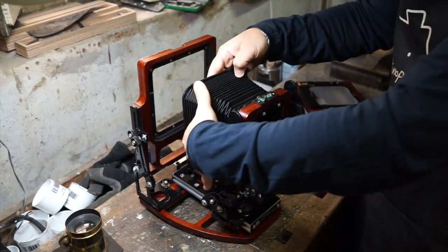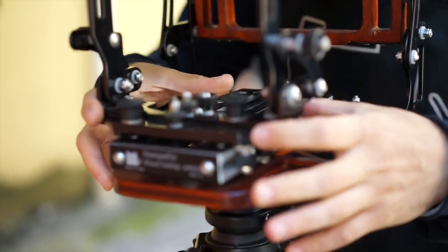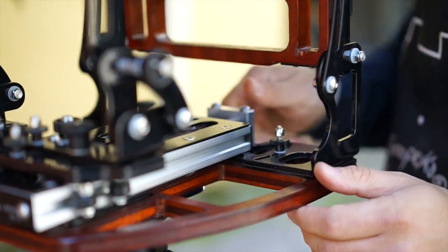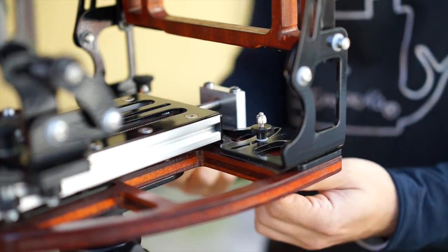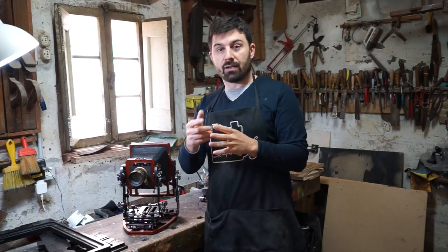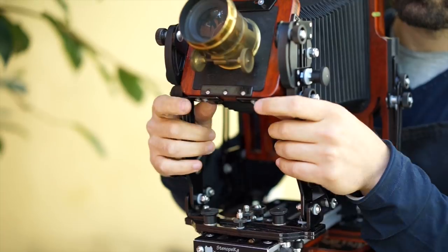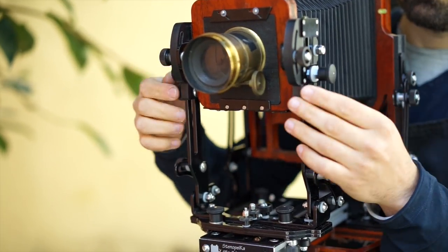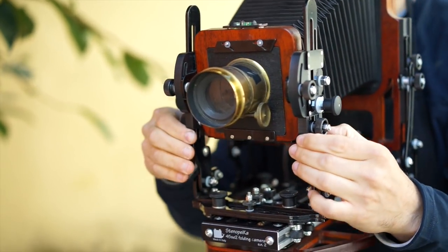I created a folding camera — foldable, transportable — but with the same movements as a view camera: shifts horizontal and vertical, base tilt on both sides, both rear and front. The front even has a double tilt, both base and lensboard. Every movement unlocks with a single knob. For the shift, for example, you only have these two, and for the tilt, two more. There's some weight and slightly more bulk, but the advantage is a very robust camera — you could drop it from the third floor of a building and it would keep working — plus full movements and complete control of the image.